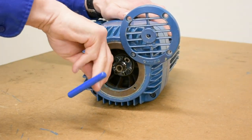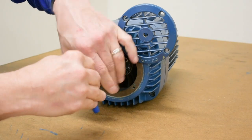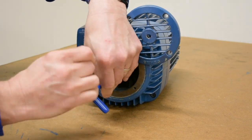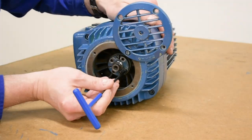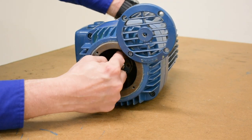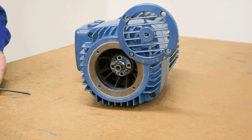The thread is right-hand thread. So once we loosen the four clamping bolts, we have to rotate the adjusting nut counter-clockwise. The pitch of the thread happens to be the maximum to minimum brake adjustment range. So the common adjustment is one revolution of the adjusting nut on the thread. The slang for that is a four-hole adjustment. But notice on the adjusting nut there is a fifth tap hole.